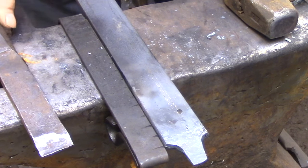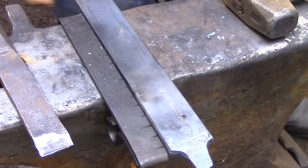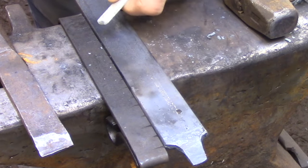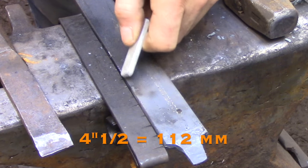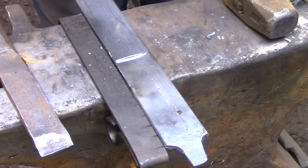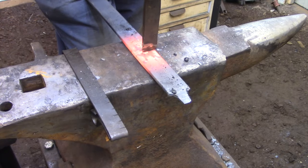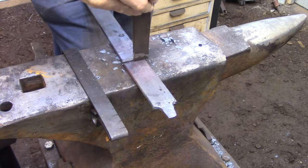Here I've just been spending a few seconds figuring out how I'm going to lay this on the anvil in order to cut it to length — which marking I'm going to use on the ruler. I've decided to position the top shoulder of the bar at the end of the ruler and count back four and a half inches, which puts the mark fairly close to the center of the anvil. I'm placing a chalk mark on the metal because it's going back in the fire and I want to make sure that part is in the hottest spot. It'll be gone when I bring it back to the anvil, that's why I need the ruler.